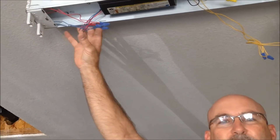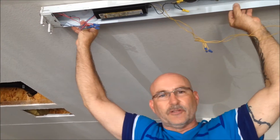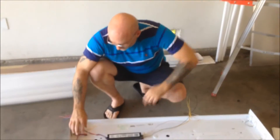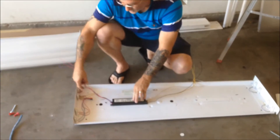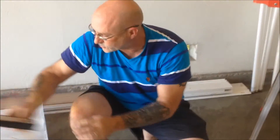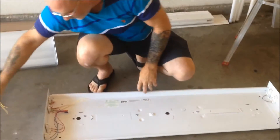It's very quick and very simple to do, and we'll get started doing that right now. We've taken our light fixture off the ceiling, checked our two-wire tombstones, and disconnected the wires to the ballast that comes with the fluorescent light. We no longer need the ballast, so we'll take that out and set it off to the side.